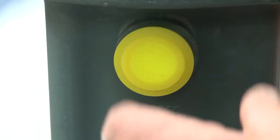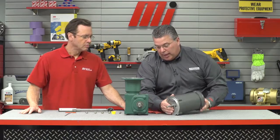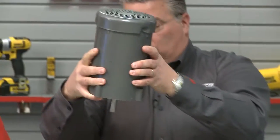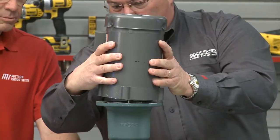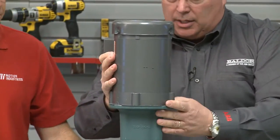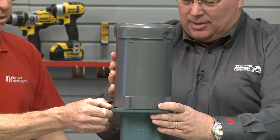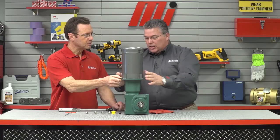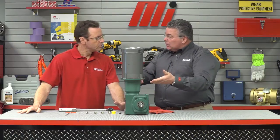Is it time to put our motor up there now? Now that we've done that, we want to remove the access hole cover and locate the motor. Having the motor lined up with the shaft in the right position, we then position the motor and locate it onto the gearbox. So now the motor is in position, the gasket is in position, and the coupling is aligned.